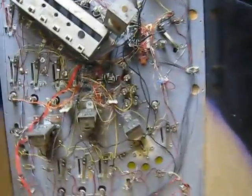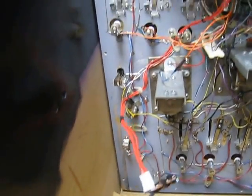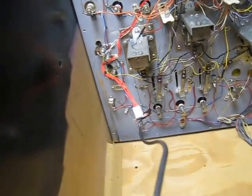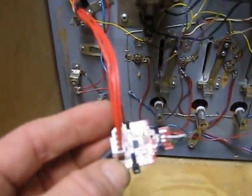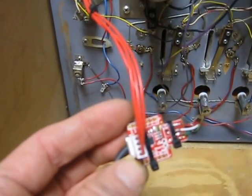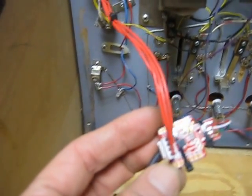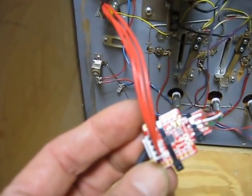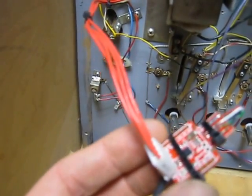So there are two main connections that come off the Playfield. One of them is this guy. This is the communications chain. It basically uses the top of one of the Cypress boards to do a USB to serial port conversion. The serial port that comes out of there is a 5-volt serial protocol, so from this point on, it's 5 volts.